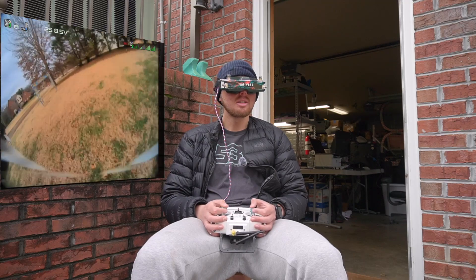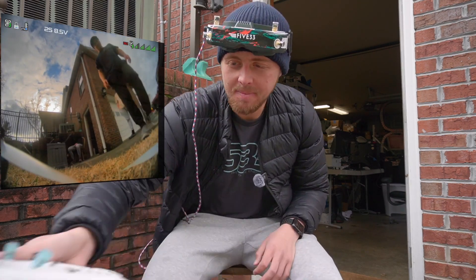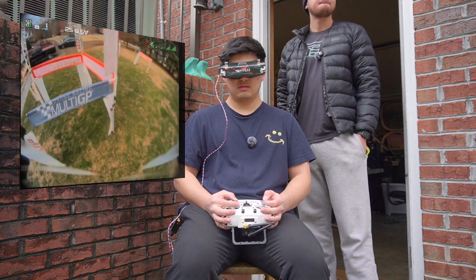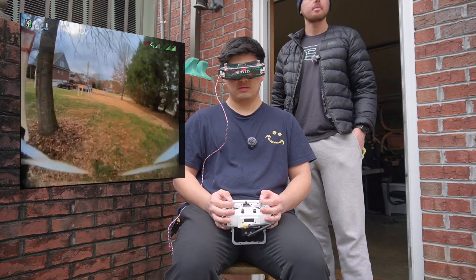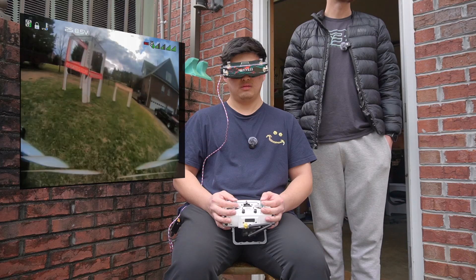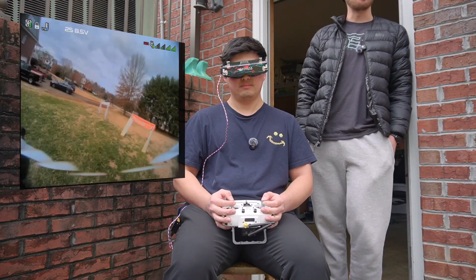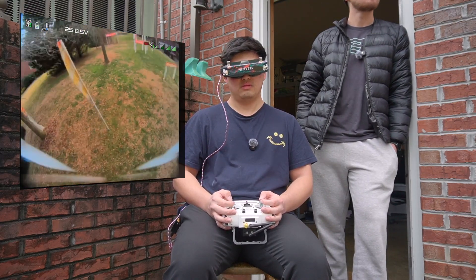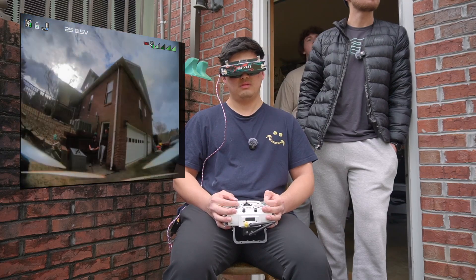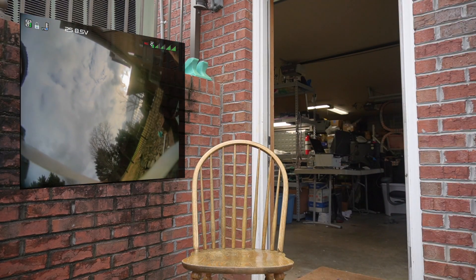Flies good. Alright Charles, it's your turn on the MPU 6000. That's a good baseline — flies good, reliable, bent props. Now it's time to put the ICM on. Now that we have the baseline, we're changing over to the ICM gyro, and this is where one of the best features of the HD Zero flight controller is going to shine. The flight controller has a receiver built in, and the HD Zero VTX plugs straight in on the new versions.